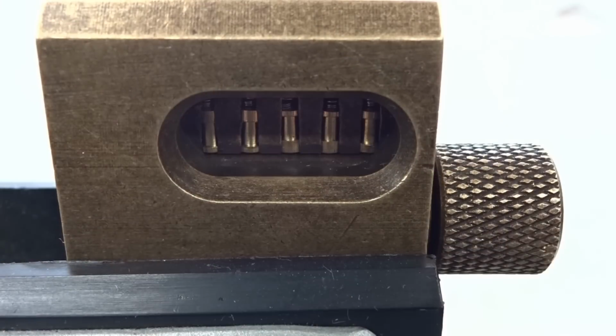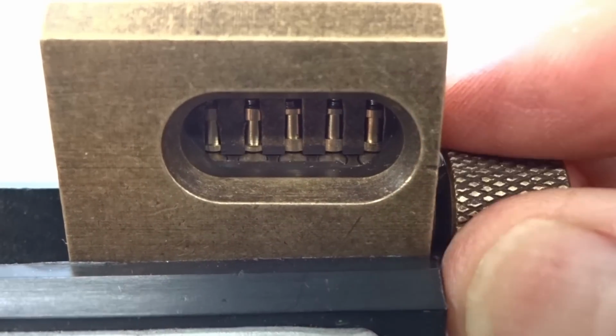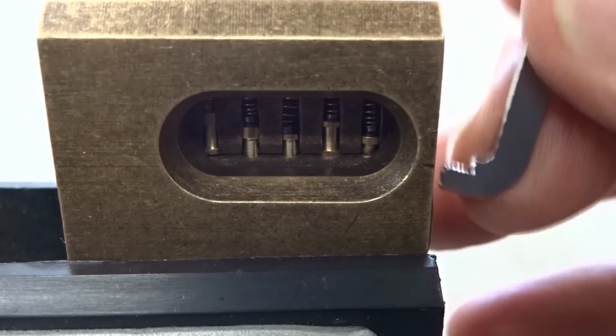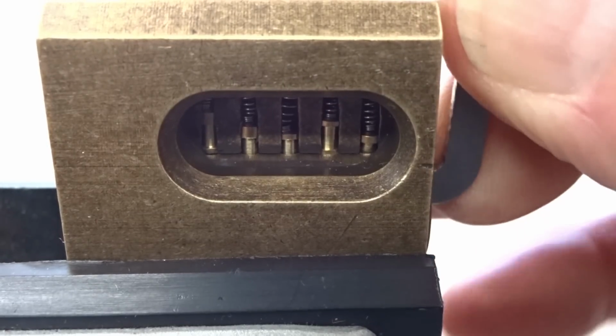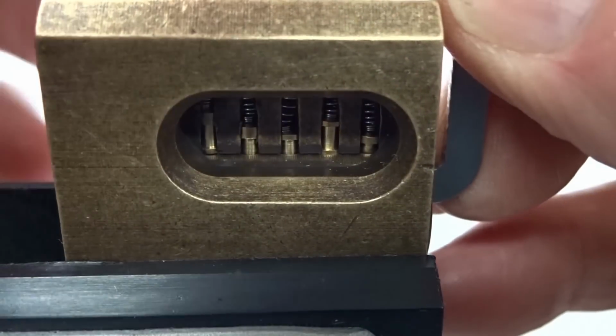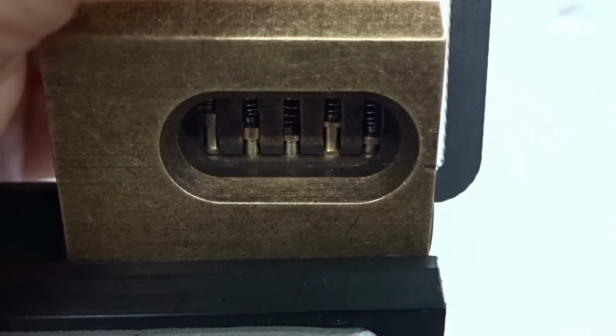All right, here we are zoomed in on the cutaway section of the 5-pin spool lock, all spools. The key is in it, so we're right at the shear line, and that's what we're shooting for, so we'll be able to turn that core. I'm going to go ahead and pull the key out, and you notice immediately they all offset. Now I'm going to try not to knock anything over. I'm working at some pretty odd angles here, but the microphone literally is right above the tip of my finger there. I'm trying not to bump it while still maintaining some tension here.